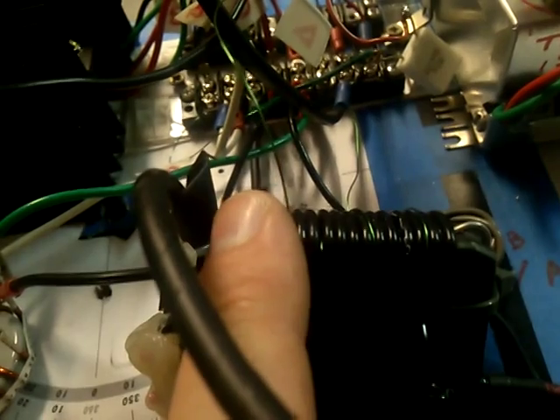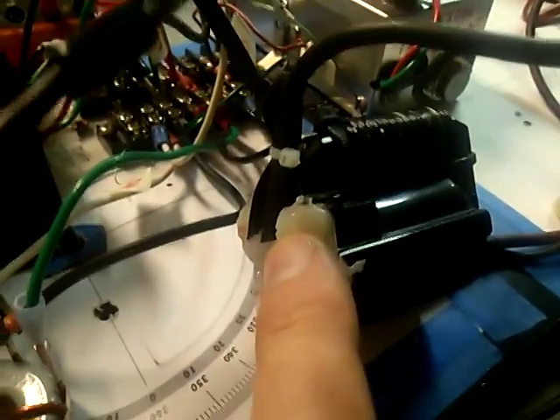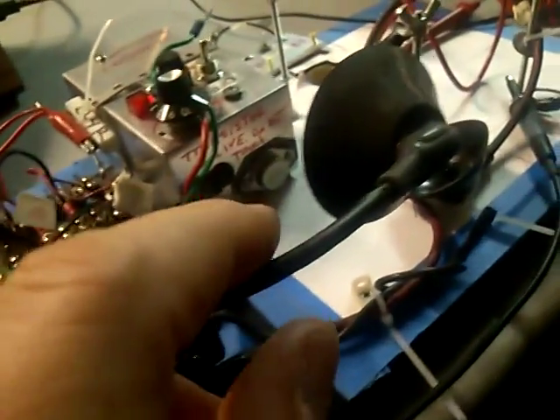Then there's real thin number 26 magnet wire wrapped in between — about five turns of that, which is about half of what we have on the drive winding. We found the ground on here; the ground wire is hooked to the stud and it's shorting out down over here near the high voltage lead.